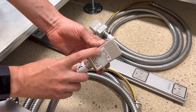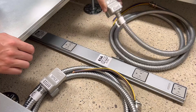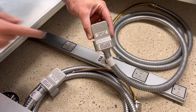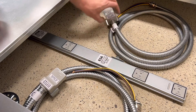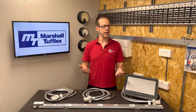One of the options is a 32-amp unfused connector and a 13-amp fused connector. These tracks are rated at 63 amps, meaning you could feed them from a 63-amp protective device. So the 13-amp tap-off unit makes sense because it's protecting the smaller conductors inside with a fuse. But what about the conductors in the 32-amp version? What's protecting those? Only the 63-amp protective device at the source.